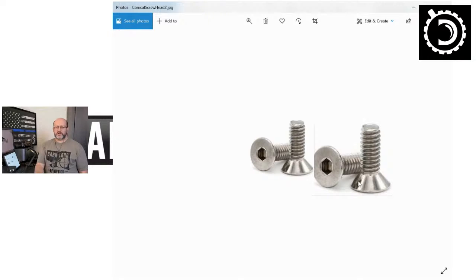And I started looking into this and I realized that the screws they use are soft for some reason. They strip easily. And they have this kind of a conical head where if you have any sort of a tolerance stack up happening, these type of screws will exacerbate it. If everything is perfectly aligned, they will be totally fine. If you are close to perfect, if the tolerances are good, these screws work perfectly fine. If the stars align just wrong, and you have some sort of a tolerance stack up happening between the ring halves and the scope tube, this will make it worse.